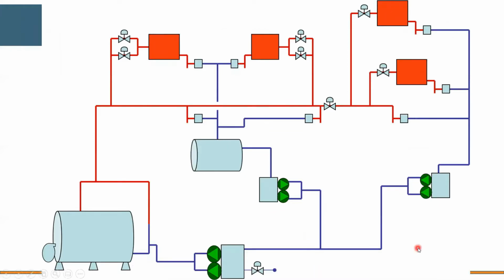I threw this in as a general schematic, and we'll be referring to it throughout the hour, so bear with me a second as I talk this through. Let's say we've got a high pressure boiler in our mechanical room that's producing 100-pound steam. That 100-pound steam gets sent out through our system. We might have some applications where we require that high pressure steam, like a sterilizer, maybe an autoclave, something in our system that needs high pressure steam. If we're going to control that with some type of control valve setup, we come off of that heat exchanger with 338-degree condensate. It's too hot to touch or to transport, so we dump it into our flash tank. That flash tank allows the steam to give up its energy and cool down a little bit, so we can route that condensate into what we call a condensate return unit, simply a receiver with some pumps.